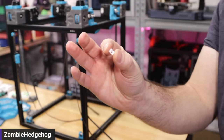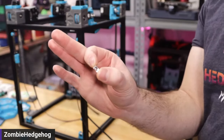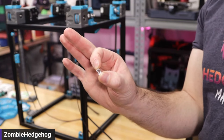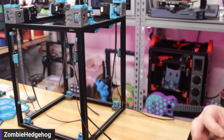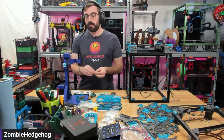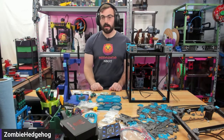These are little holders for M3 nuts — a no-drop nut mod. It's a small printed piece you slide your hex or square nut into, then slide into your extrusion so they don't fall out. Once you put it in place, it stays in place. I should have used these from the start — they would have saved a lot of frustration keeping nuts positioned. Both square nuts and standard M3 nuts work in this extrusion.